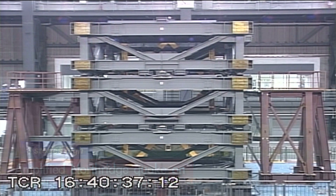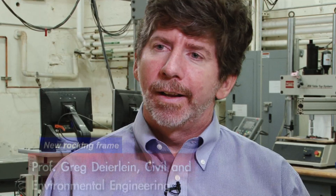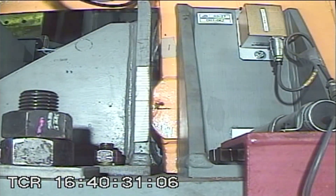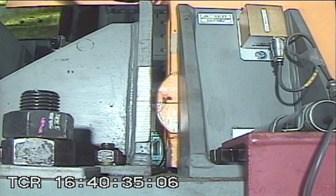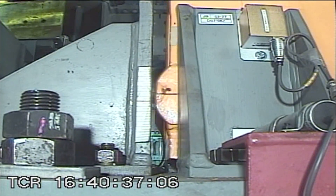A lot of typically lateral deformations occur to the building. Now this rocking frame is a little bit different in that it moves laterally but it also rocks upwards. If you happen to be standing next to the rocking frame, you're going to feel the floor around you kind of being lifted up, because the column is rocking upwards, and that lifting up might be on the order of three or four inches in some of these extreme earthquakes.